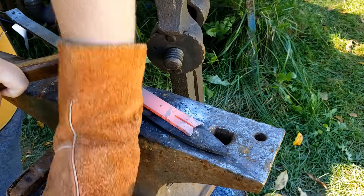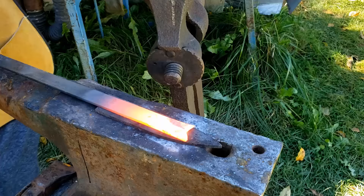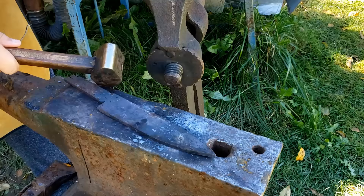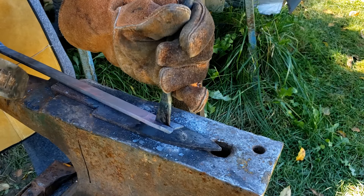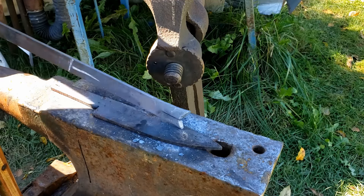So you will be a bit curious. You can see that I placed a piece of mild steel under the metal I'm trying to cut to avoid cutting into my anvil and damaging it.